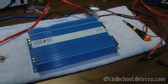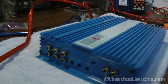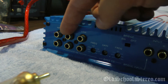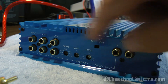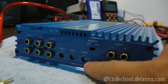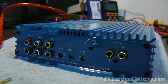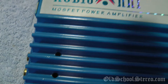Now on to the connections of the AudioArt 2400HO. As you can see on this side, we have RCA jacks — I'll explain this further in just a minute about what these are all about. We have a frequency for your crossover, gain, and frequency for the bass EQ, and bridge on and off. And you might say, well what about the gain for each channel? Well, as you can see, AudioArt has it nicely hidden.